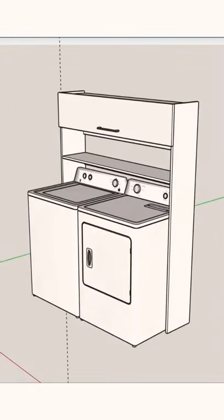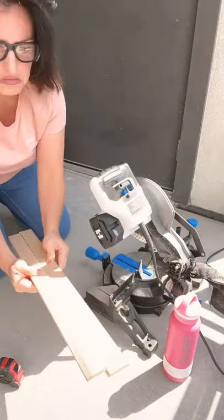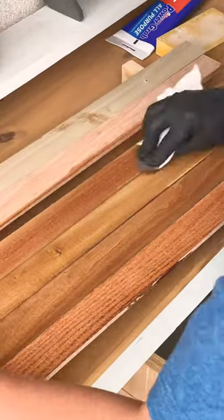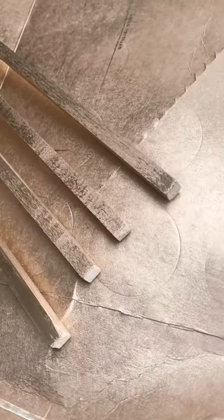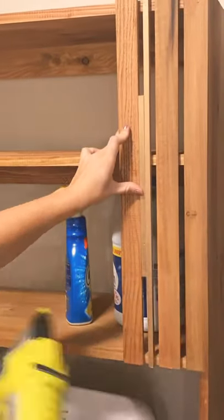Earlier I talked about my original design where it had a door along the top — that wasn't going to work. So instead I grabbed these thin 1-and-1/8-inch slats and decided to use those to create a faux door on either side. I cut each slat to 24 inches and stained them the same color as the rest. I wanted a little bling, so I grabbed some 1/4-inch pieces and spray painted them gold. I attached the slats right at the edge and then used one of those 1/4-inch scrap pieces as a spacer — two slats, then one gold piece, two more slats and a gold piece, then two more slats.